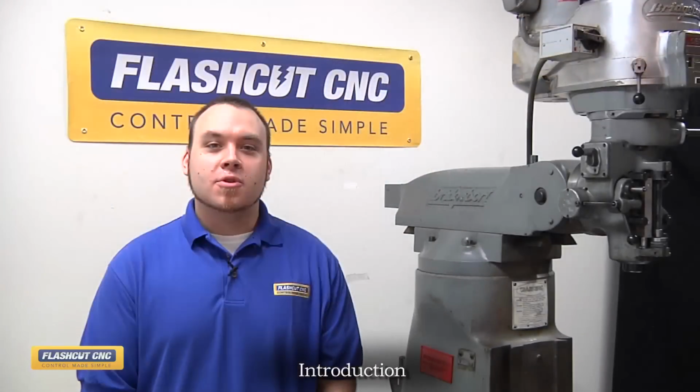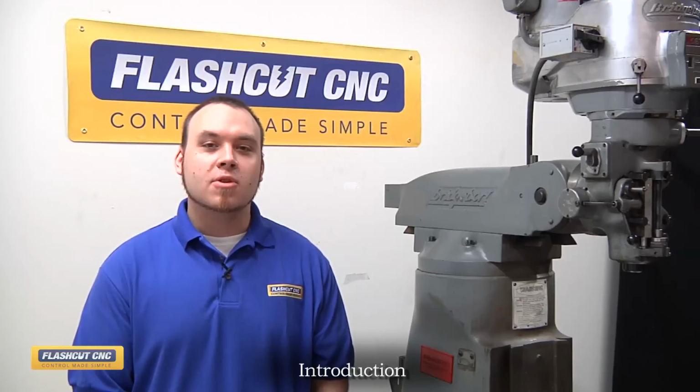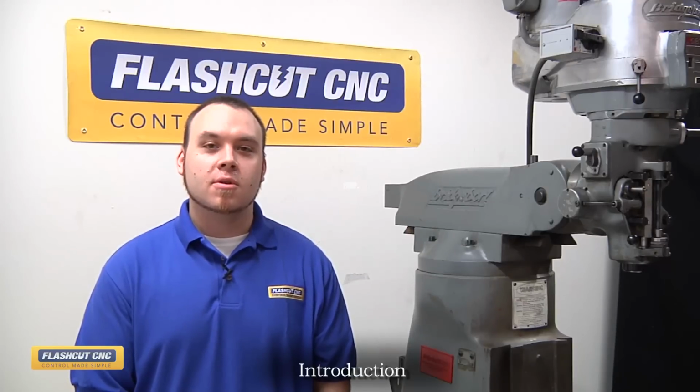FlashCut offers both servo and microstepping options to control your machine. Today we will be retrofitting the kit with a servo controller. Other optional equipment includes a limit switch kit for preventing over travel and for homing, a relay box for turning the spindle on and off, a remote pendant for controlling the machine away from the PC, as well as a variable frequency drive for controlling the spindle speed.